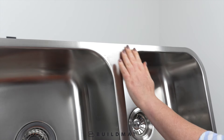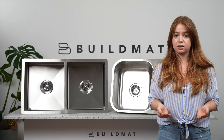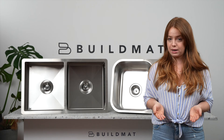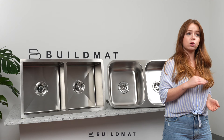You can see the curves on the pressed sink are very wide, while on our handmade sinks they are very narrow. Tight corners are harder to achieve with pressed sinks, but hand-welded sinks like ours create much tighter corners, which maximizes sink space. You can see there is so much wasted space in comparison to a handmade sink, which has an almost perfectly square corner.